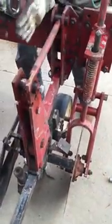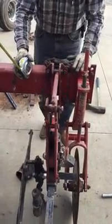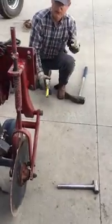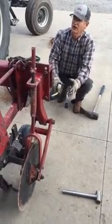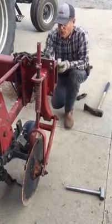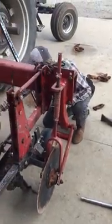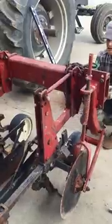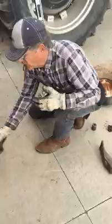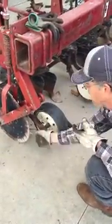So if you can get this a few more inches in, and this gauge wheel forward, you'll eliminate a lot of your plugging, because what happens, there will be a ridge of fresh tilled soil right here from the pass you made the other direction. And it's got to run in that loose soil, and it will want to plug. And I would also put this gauge wheel, or one like this, over here, because then the wheel, if it's plugging here, you want the wheel turning on this side of the framework, because this action of turning helps keep it cleaned out.